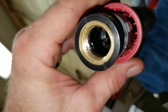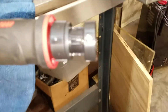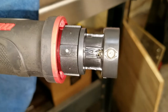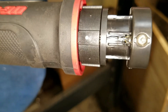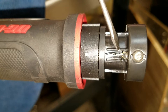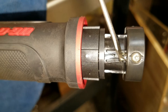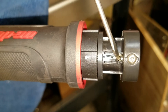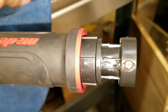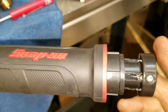And likewise, you put a solder on the joint in there. After doing all of the above and it's still not working, I found that this little ground wire was barely touching but not touching the solder joint here — or it was probably attached to the contact inside. Needless to say, we soldered it back up and we'll see what happens.